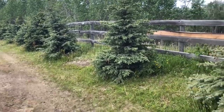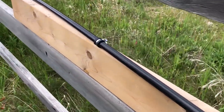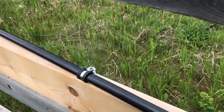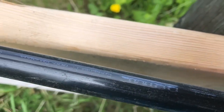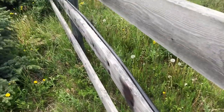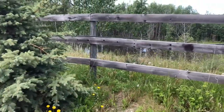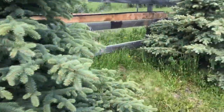The next project I'm working on is hanging this irrigation pipe. This one is doubled up, but all it is — I just use this hose clamp here, open it up, and just screw it right in. Pretty simple. We're trying to keep the labeling up — you can see the little white marks — so we're trying to keep that up to make sure the pipe is decently straight. The reason we want it straight is so that it doesn't bend out of alignment when it heats up. I'll just put a clamp at each of the trees — one there for that tree and one there for this tree.